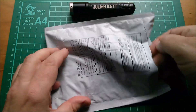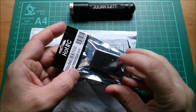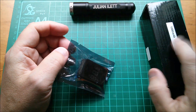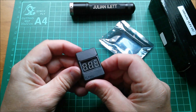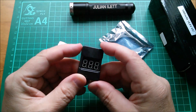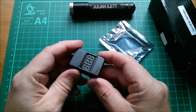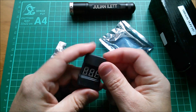Let's take a look at this other one — what's in here? It's a HotRC radio control voltage display — I can just about make out the three seven-segment displays. It's a voltage display with a buzzer alarm for lithium battery packs. Here's a lithium battery pack, I think a four-cell. Opening it up: three-digit display, a couple of piezo buzzers, a button for programming the alarm voltage, and a port for up to an 8S pack — so a nine-pin connector. I bought this one because it's neatly packaged in a plastic case.